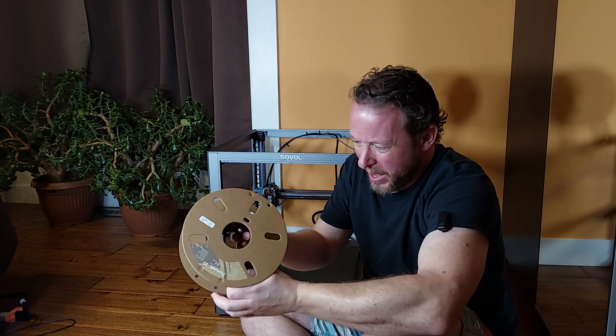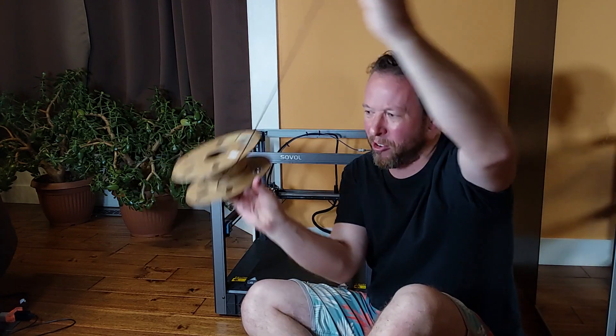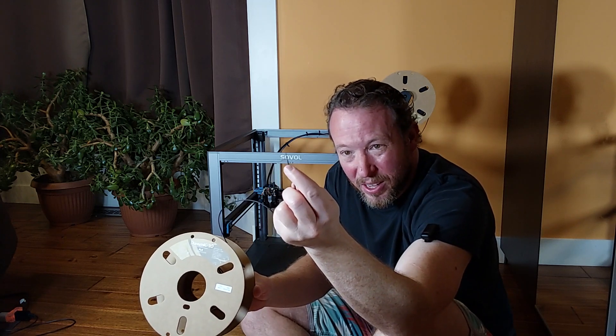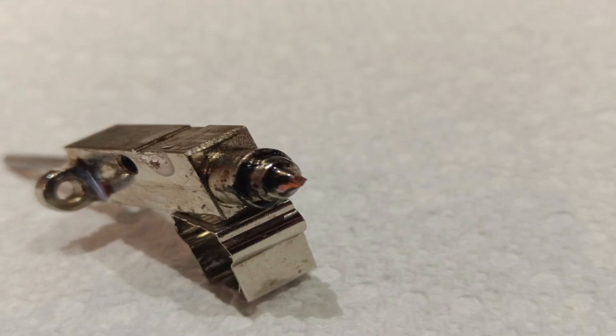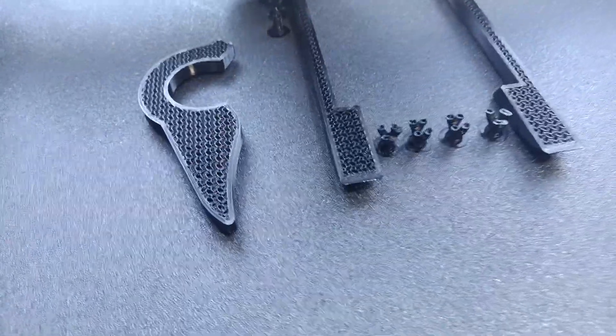This time I fell victim to filament tangle. With this particular spool it was so bad there was actually a knot in the filament. You can see how the extruder was just pulling and pulling, really gnawing away at the filament and nothing came out. So that was another fail. Then I thought it might be time to check on the hotend again — and it turned out my entire nozzle was buggered up, clogged up, and completely done. So I put the spare nozzle in, gave this file another shot in the Orca Slicer, and put in different settings: four wall layers and gyroid infill at 20 or 25 percent, with thick bottom and top layers, then sent it.